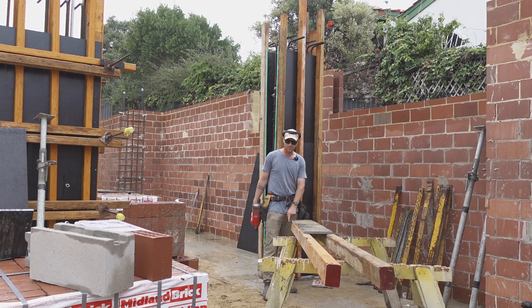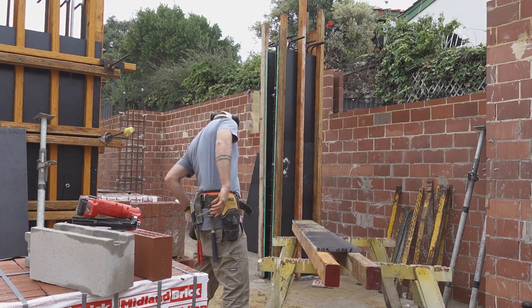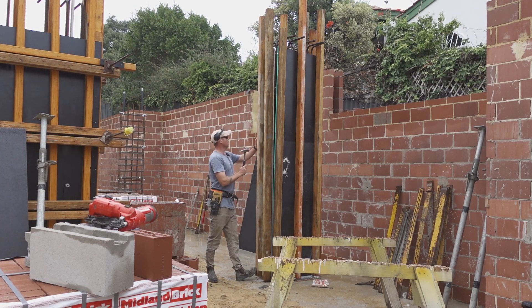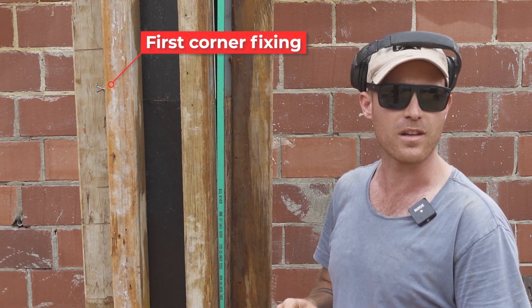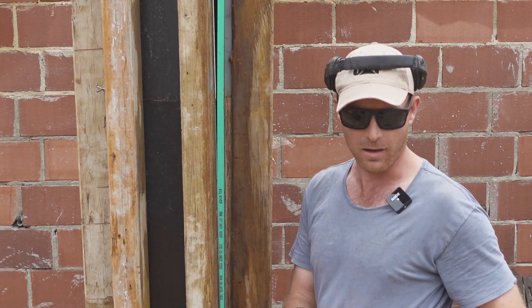This is the small side — we just keep our timbers flush on this one, flush on the sides. We don't want to nail this off because when we plumb this we still need it to be able to move. So what we do is we bang two nails — one there, one the opposite way — and we twist them up. Usually I use three-inch nails but I don't have any, so this is an example of why nail guns are the gift that just keeps on giving. The paper actually grips and it works really well for this.